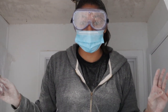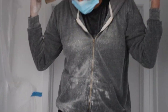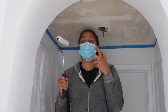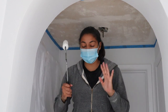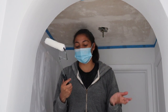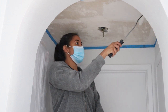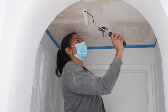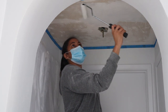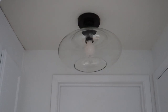This is what you're going to look like when you're done sanding — you'll get dirty, so don't wear any clothes you care about. The goggles and the mask are a must; definitely make sure you're wearing some sort of mask when you're dealing with paint so you don't inhale the fumes. I'm using this small roller — it's my favorite thing to paint with — and since this is a small area it should work perfectly. I'm going with a flat white color; the accent color will go on the other walls.